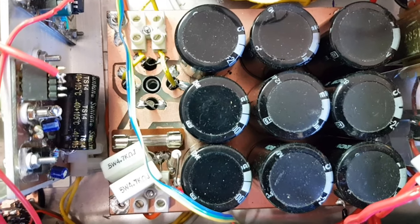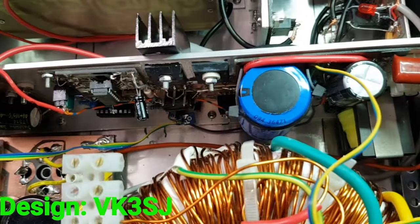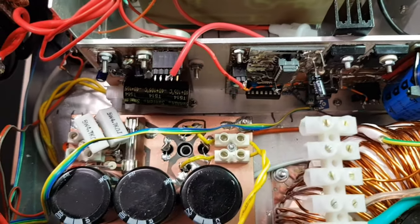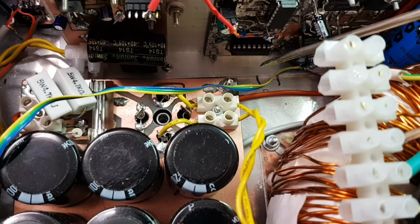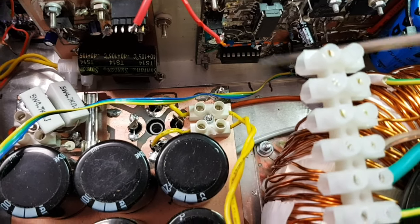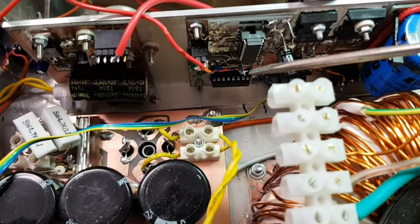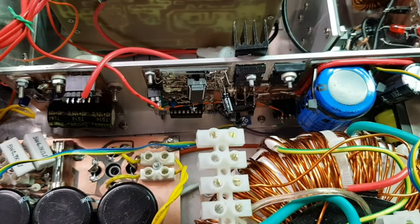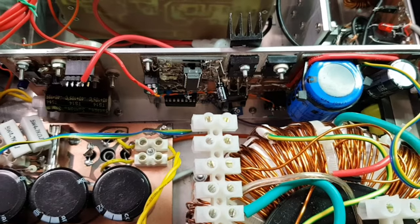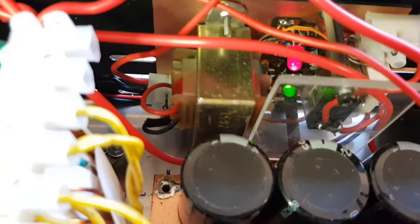This board is the rectifier. It's mounted underneath and is flush with the bottom of the chassis, along with the capacitor bank, 9,000 microfarads at 250 volts. Then this board running along here is a switching regulator. It works exactly like a conventional switching circuit. The PWM chip is hard to see because the board is mounted vertically, but it's right there, and that's a TL598. That drives this IC here, which is the high side of an IR2110, into a switching FET there. So the regulator can take 100 volts DC in and provide 0 to 80 or 90 volts fully regulated, fully variable on its output. And over here on the side, we've got a soft starter just to alleviate any switch-on thump.